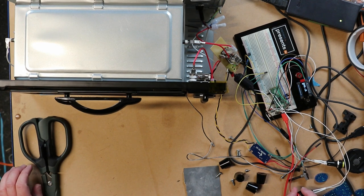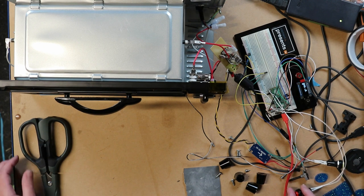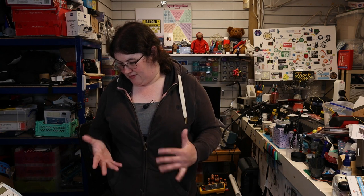We're going — from 20 we've got to 25, 26, 27, 28 — so I'm keeping an eye on it as it goes up. It seems to be staying within about 10 degrees of the set temperature, which is a lot more accurate than with the original controller. We've seen that the theory works, but it wasn't the safest — I don't really want exposed mains on my desk whilst it's in use and the control stuff was all on the breadboard, which isn't ideal. I'd like to make it something I can use more often.